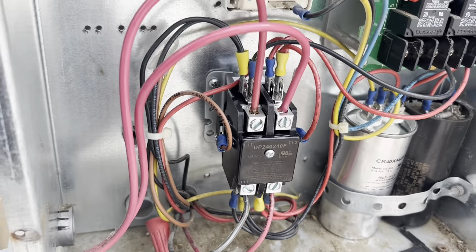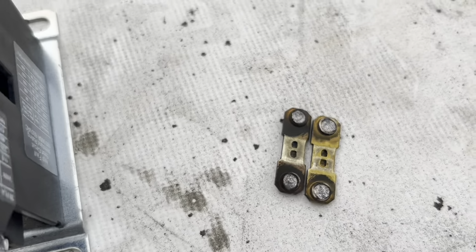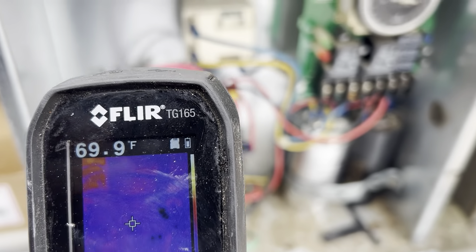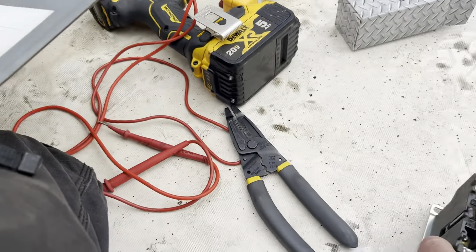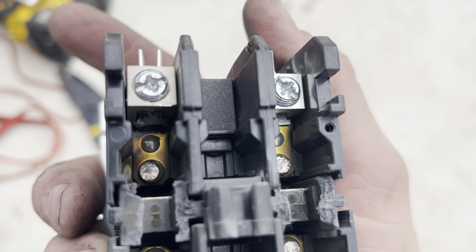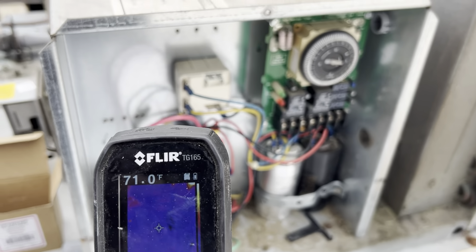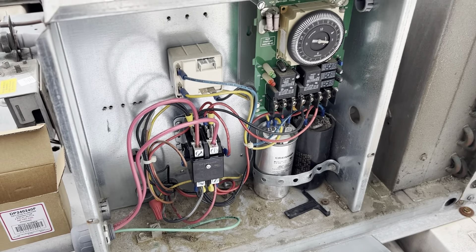145 to 177 — that'll work. New 40 amp contactor and new 40 microfarad capacitor. It burned up. And for those who thought that wire wasn't a problem because it wasn't at a high temperature — look now. There's no evidence of it at all. It wasn't getting a good connection on the north side of that terminal right there.